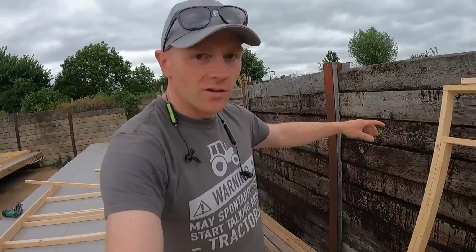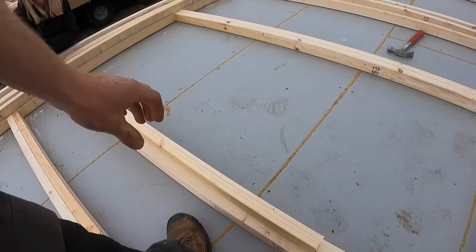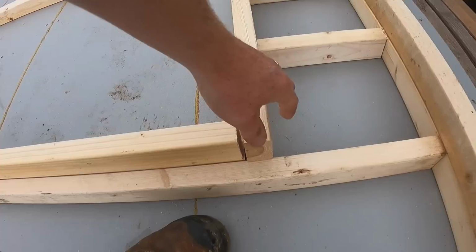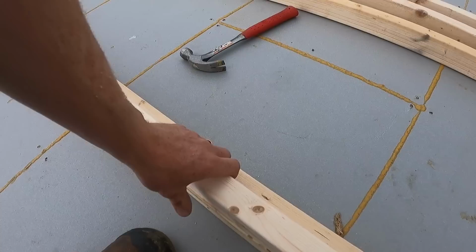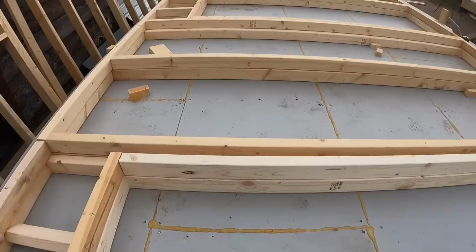Just trying to explain to Joe, we need to allow for a double timber on top. And that's the full height of our wall, and that's everywhere, it's including the internal walls. So, or the centre walls. So if we work through everything we already got here, we won't need the extra wall plate until the walls are up, so we can always order them for next week or whenever we're going to raise the frame.